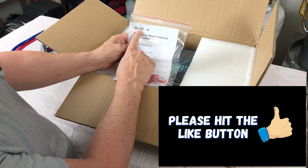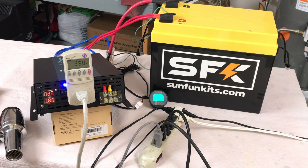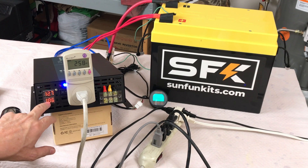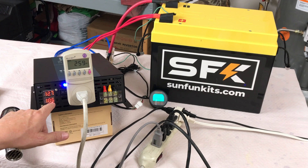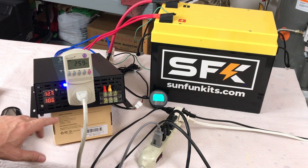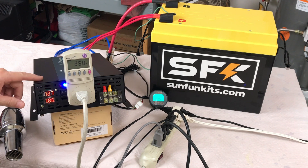I don't really know how good the inverter itself is — I see a lot of videos about it and people seem to be happy with it, so I thought we would give it a shot. I'm no inverter expert by any means, but I've got this set up hooked up to my SFK 280 amp hour battery. It's got a 200 amp BMS in it. The inverter is kind of interesting — showing 106 volts on the output here. When everything is shut off I'm at about 115 or 116. When I first turned it on I had 125 volts output, so I don't know how accurate that is or if I've done something to the inverter. 12.7 on the battery — that's fairly accurate, about 50 percent.